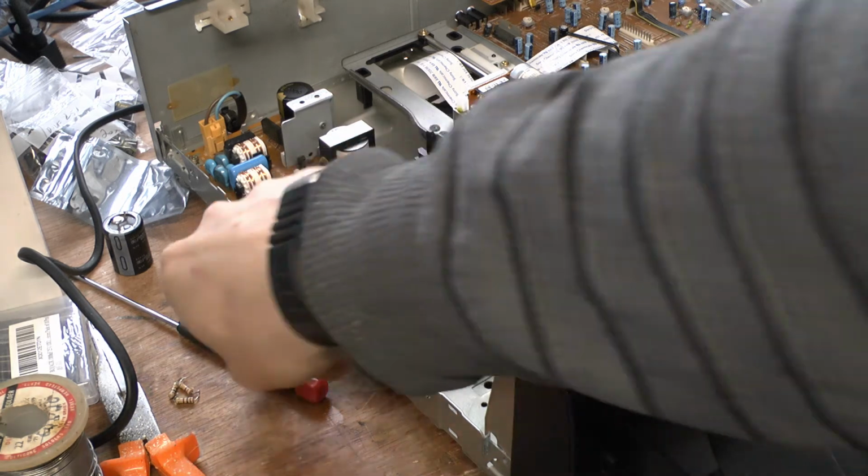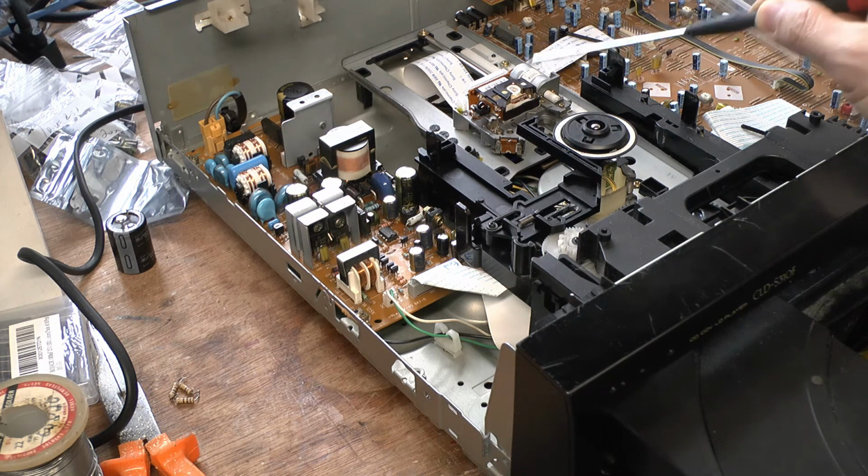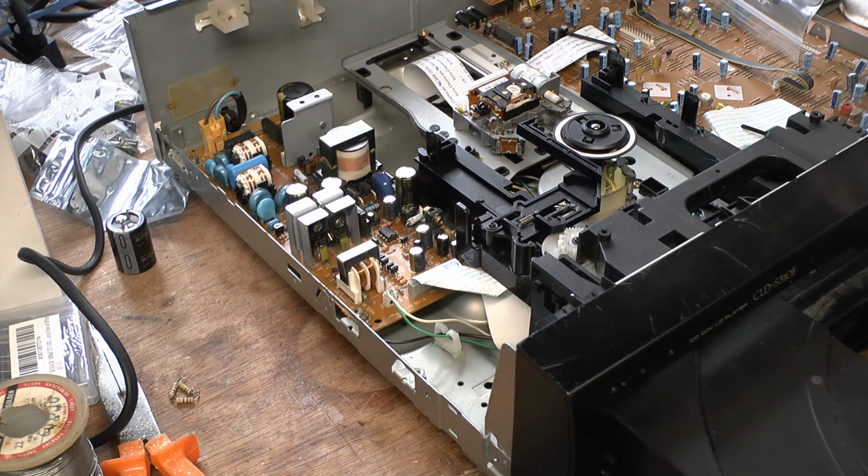As for the laser that's in here, we've visited this one before. See, it's gone stiff. See that? So there's no movement out of that whatsoever. That should be free moving in there, and it isn't. When I move it in one direction, it stays there. See? So it's staying there. That should be free moving in there. So that laser is what's known as faulty.